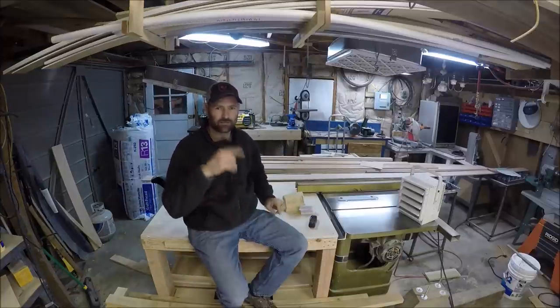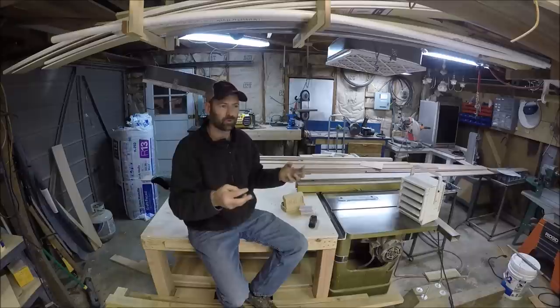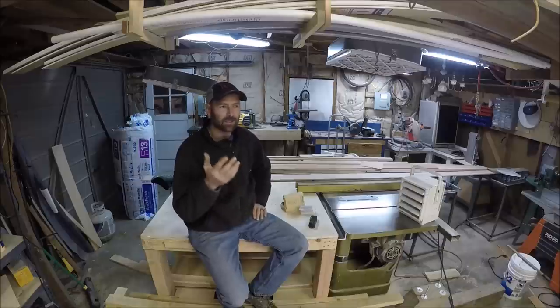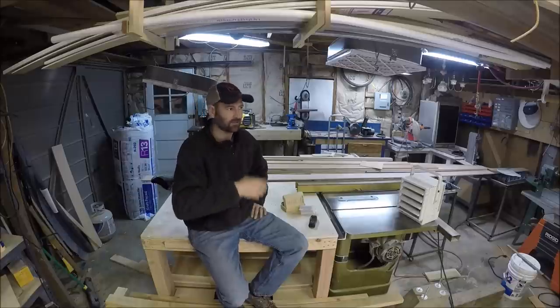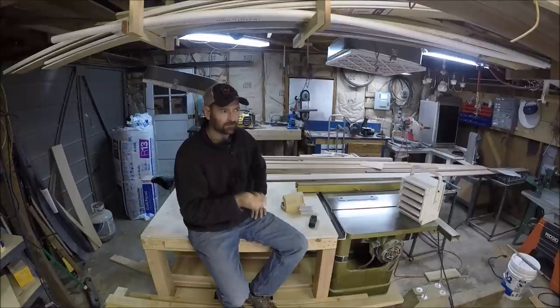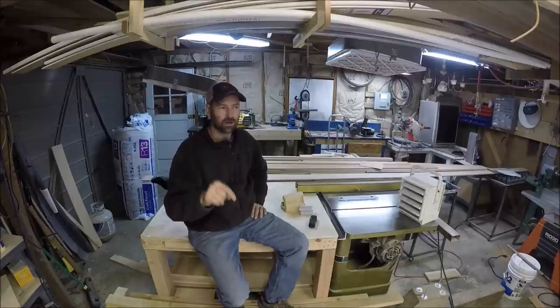All six sides of the soffit and the fascia are pre-painted with primer. What that does is it seals the wood, and it's going to make it last longer than if it's not painted. That is for a case, say, 50 years in the future, where the roof is starting to deteriorate, no one's cleaning the gutters and things are backing up. It'll last just a little bit longer. The first one lasted 62 years. And having good, modern quality paint and good caulking, the Dynaflex 230, which I talk about in this video, helps.